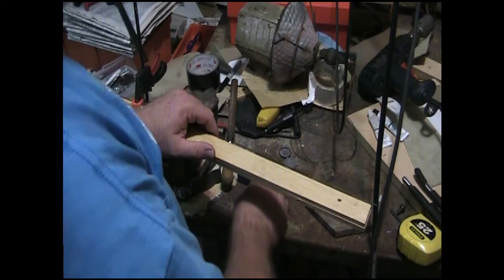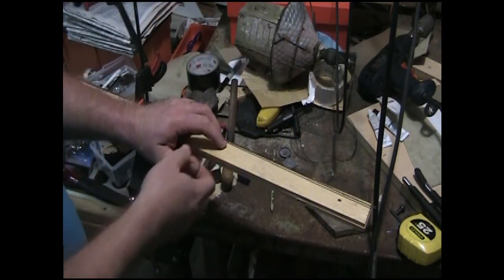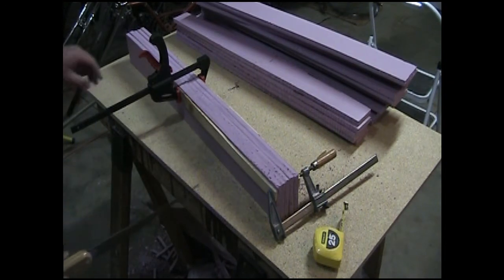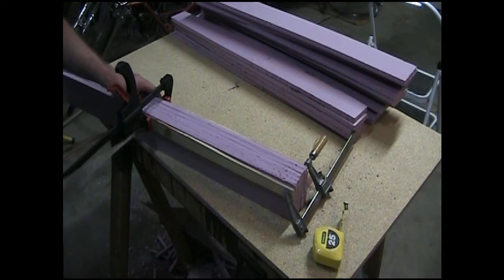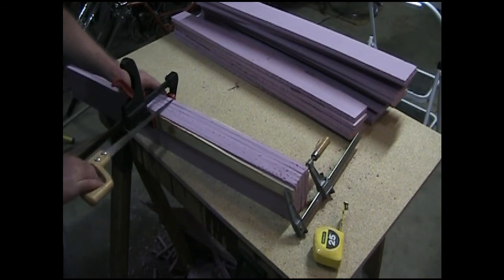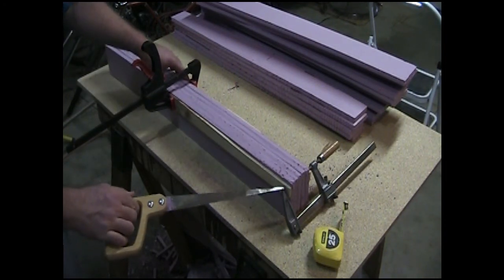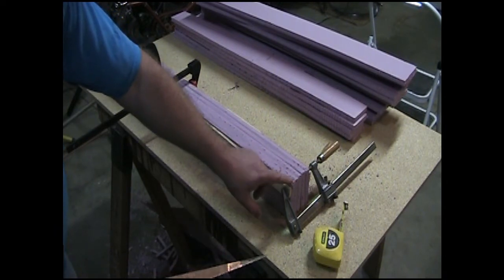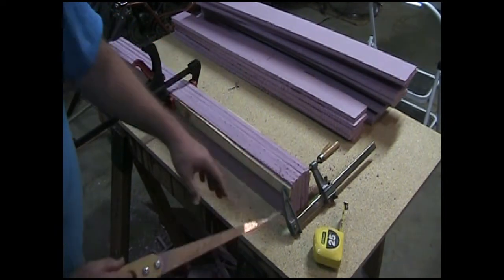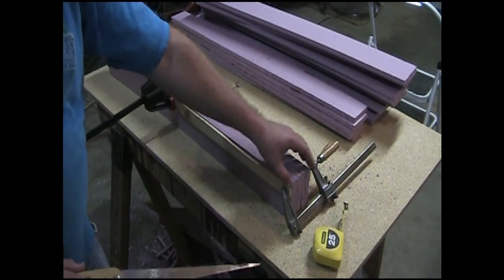You're going to want to make something because cutting those by hand otherwise is going to be even worse than it is. Alright, we're ready to do another batch of 5 here. You can see my jig's already in place. Got a clamp here at the upper end, and basically the jig is even with the top of the boards. And then we have our jig clamped at the other end here, and it is 7/16 from the top of our plank boards.